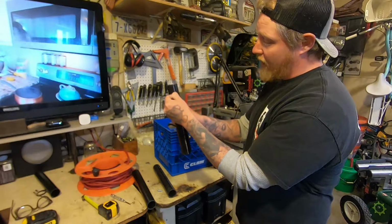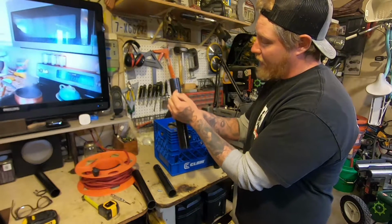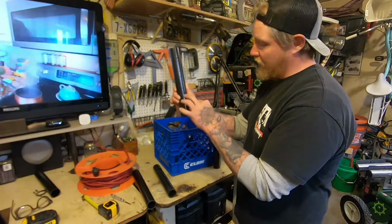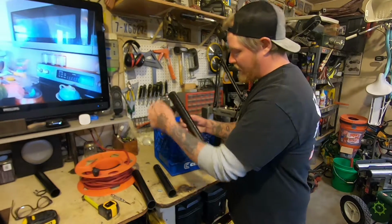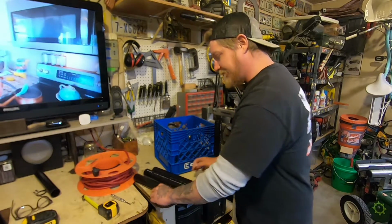So I just have to cut straight lines. Well, I'll probably flare it out on the ends there. It'll look a little nicer. And then the same down here, but it won't get that notch. It'll just be a hole in there. So we'll get these marked up 2 1/4 inches from each end, right on this center line that these all have, and we'll get some holes drilled.